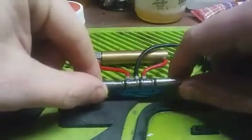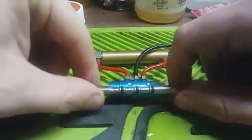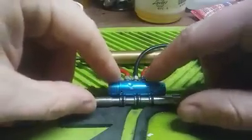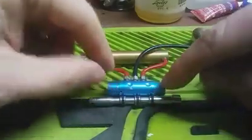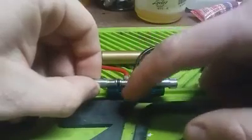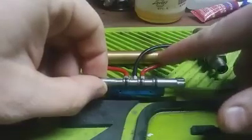As you can see the spacing is much closer — you don't have to move quite as far to cycle this three-way from side to side. That's why a lot of the traditionally faster three-ways — the Shocktech bombs, ID UFCs and whatnot — tend to be this three o-ring shaft. Now before we stop talking about the brass three-way — you have to realize you do have air trapped on either side. Look right by where the o-rings are sitting: there are vent holes here so that when this cycles and we switch back, this side has a way to vent out the gas from that side of the ram.